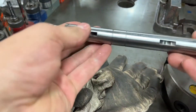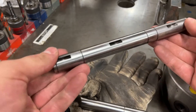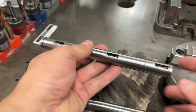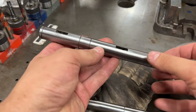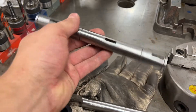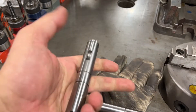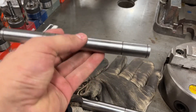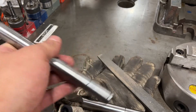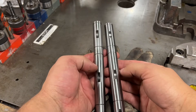So this is a job that we got tasked with. This was a bent shaft from a roller — a sheet metal roller. And essentially what this is, is a piece of three-quarter inch ground tool steel. It's pretty hard. So this is kind of like the shop repair. We duplicated this shaft out of O1 tool steel annealed and it's ground.